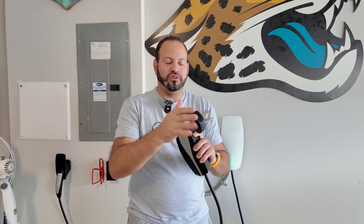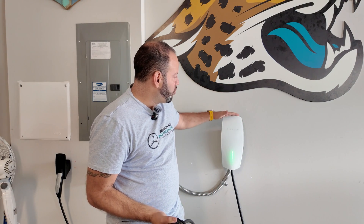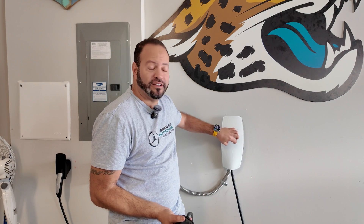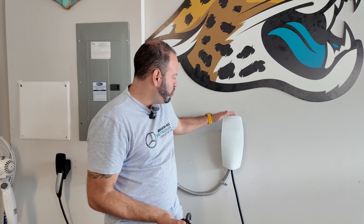In scenarios where you do have a dryer outlet, you can get that faster rate of charge. For portability, the mobile connector is what you want. If you'll be parking outside or charging in rainy or hot conditions, the wall connector might be your better bet. It also wins on aesthetics, and you're paying for the ultimate convenience of faster charging, Wi-Fi connectivity, and power load sharing options — none of which are possible with the mobile connector, but at double the price.